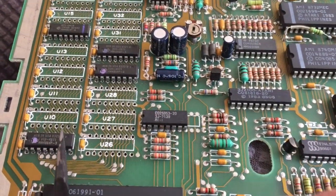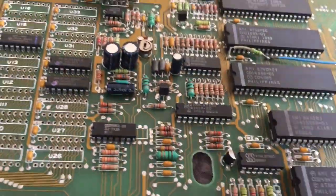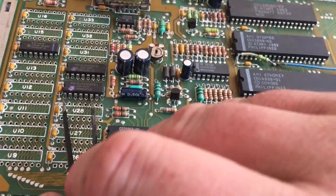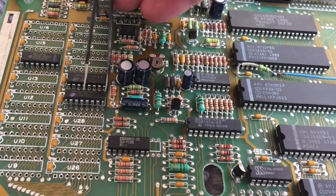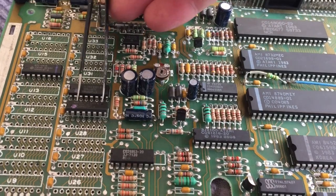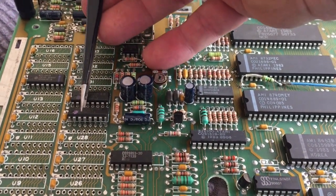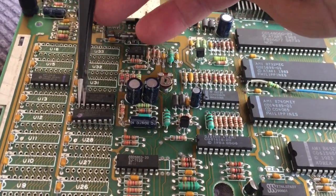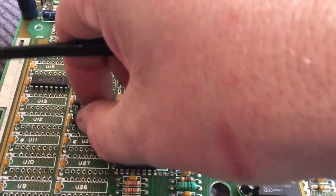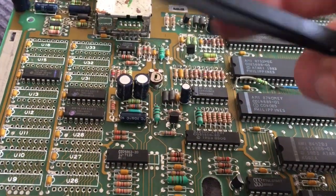There may be a little bit, but if there's more than a small bit of resistance, then the legs of the chip you're trying to remove are probably connected in some way to the board. If a lot of solder has been used in manufacture, quite often the solder will bleed through to the other side of the board. So you will desolder it and think that it's clear, but there's a daub of solder on the other side. So it's always good to have a good look round and make sure it's all clear. Flux the board before you do it.